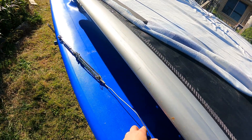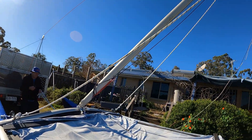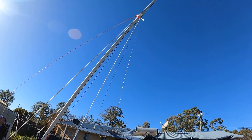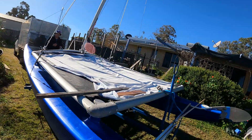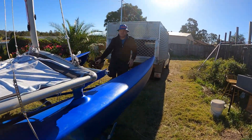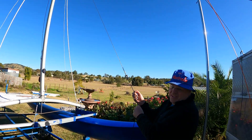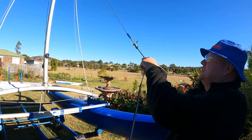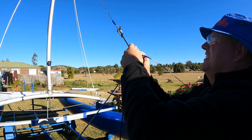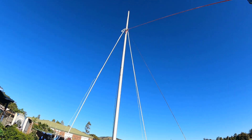Come back again to a safe position. Pulling it up the last bit. At this point you would be attaching your front stays. You have to grab this rope with the front stay attached to it, and the other one. I can still go probably a little bit higher if required. Just going to attach these stays - front stays to the back together. A little bit further to go. Make sure you don't over tension the left and right stays.